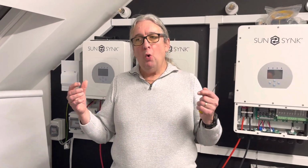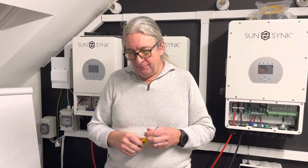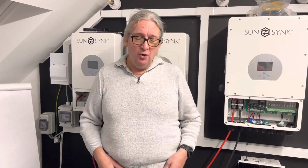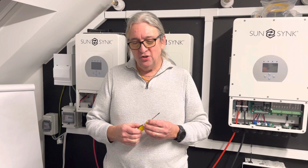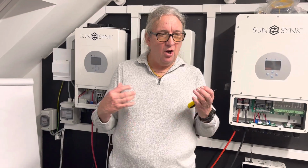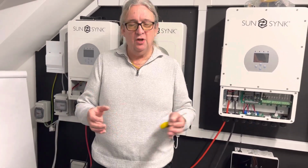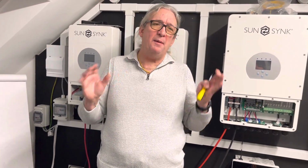Understand what you need to do to charge the battery, understand what you need to do to discharge the battery. So it's quite important. I put lots of training videos up showing how to use it and how to do these settings, and there's loads of things, because often it's something silly and somebody gets to a site and says, oh, the battery's not charging, or the battery's discharging, or it's not doing it. It's often a very simple setting, because these inverters do absolutely everything.